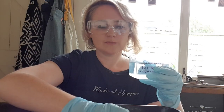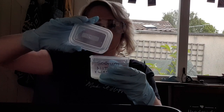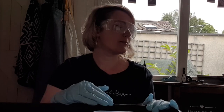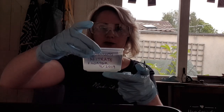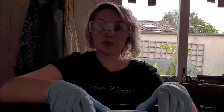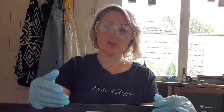I've got my water and my pre-measured sodium nitrate, and I'm just going to tip it in. I've labeled my tub as well, because one of the great things about electro-etching compared to acid etching is that most solutions last many, many years as long as you store them well. It's good to label them, especially if you're mixing different batches. It also means you don't have to throw them away — and anything used to etch metal shouldn't be tipped down the sink.